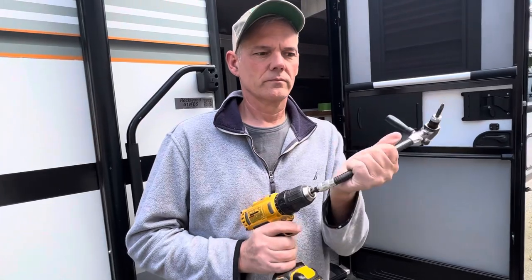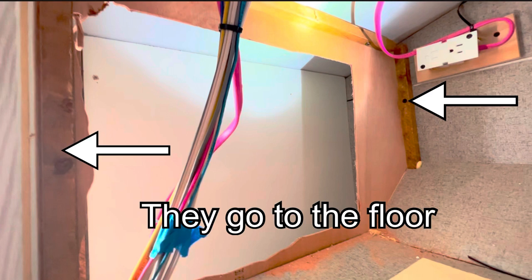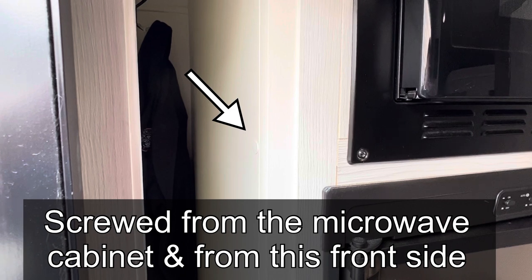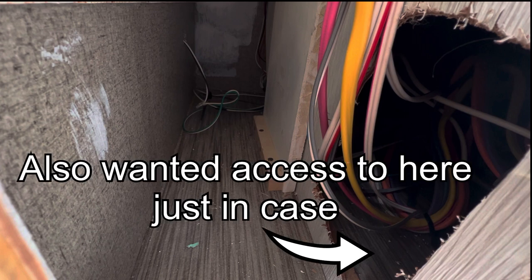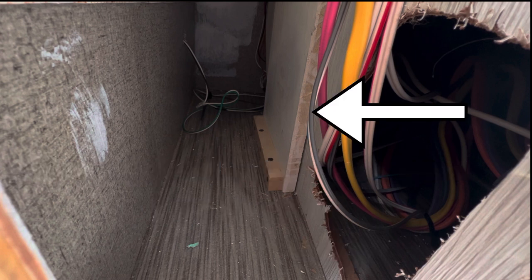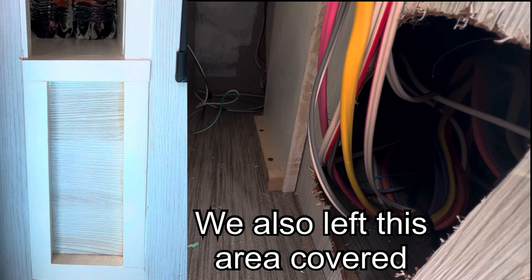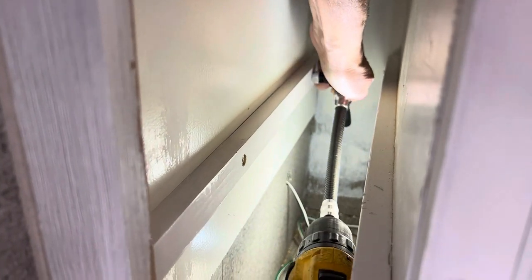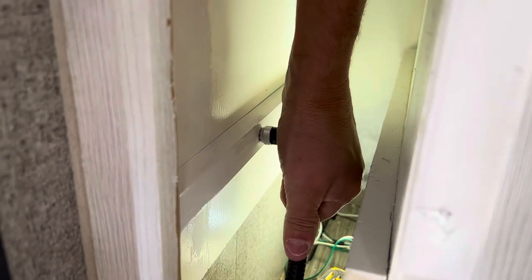Installing this was challenging as we had to screw this wall into the existing area in a very tight space. We used a very short screwdriver and a drill attachment for our DeWalt. We screwed the false wall to wood strips running down the existing wall in the back and front. Because the wires prevented us from taking it all the way to the floor, we cut another board and attached it to the bottom of the false wall and to the floor for support. Then it was time to set the shelves - they were a tight fit, wedging in to let us mark where the shelf supports went. Once that was complete, it was done.